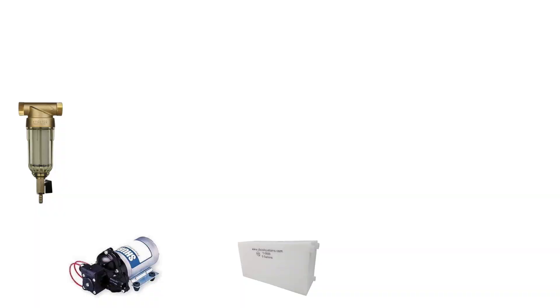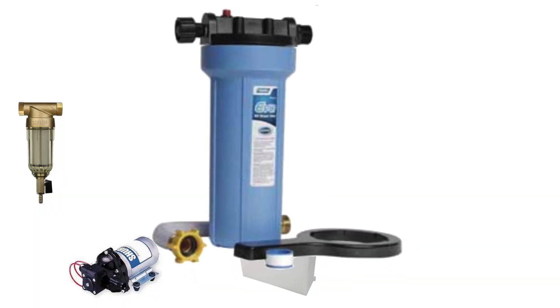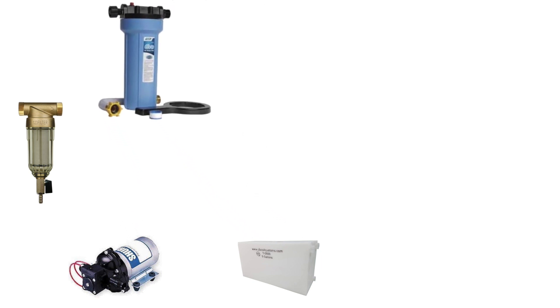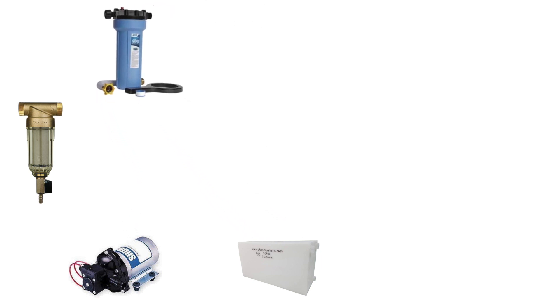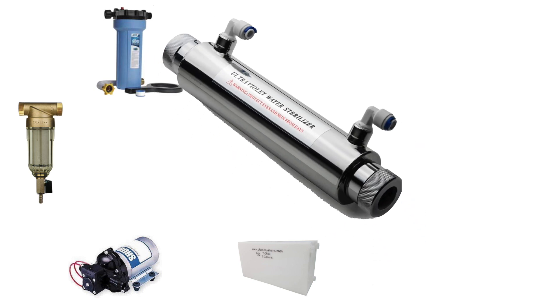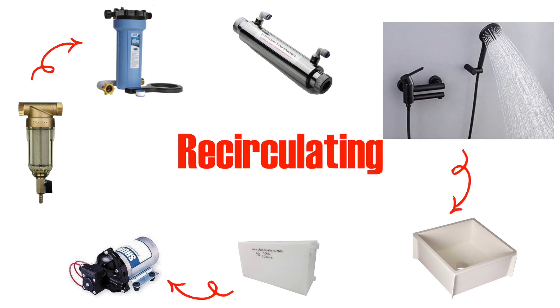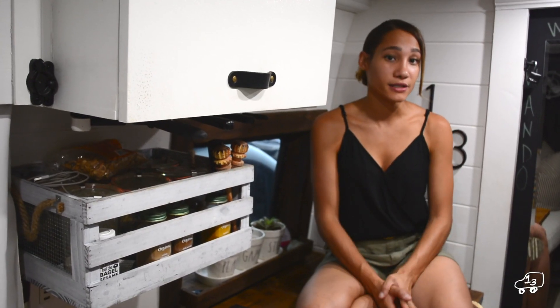Then it's going to go through a KDF filter. We used a KDF filter because we wanted to find a singular filter that was still good enough for drinking water — we figured if it would filter water to a drinking capability then it would be good enough for a shower. The final step is using the UV filter, because a UV filter will take away a lot of bacteria and will get down to 0.01 micron, whereas the KDF filter only goes down to 5 micron.